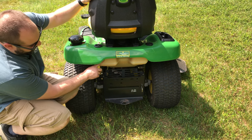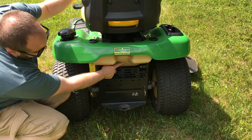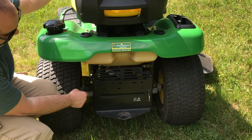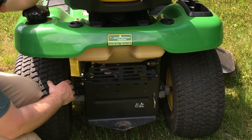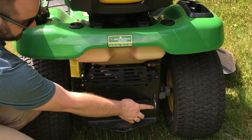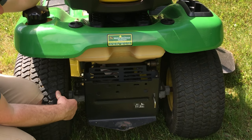Here at the back of the machine is your fuel level indicator. You can see through the tank to see where the fuel level is. It has markings for a third of a tank, half a tank, and three quarters of a tank. This is also where you would hook a trailer if you were towing a utility trailer. In the event you ever had to push this machine, you should never push a hydrostatic tractor without first releasing the transmission using this lever right here — pull it out and that releases the transmission to move it by hand.